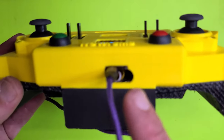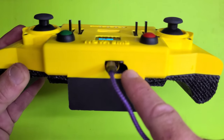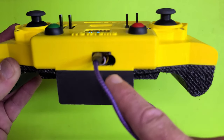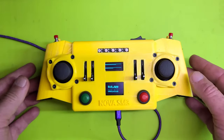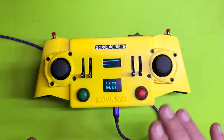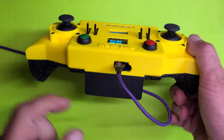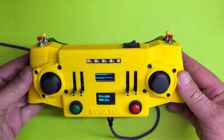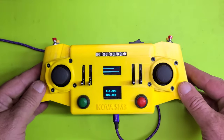Oh yeah, Jordan, one more issue. I made the mistake of asking you to move that hole down 9 millimeters, I think I asked you. Oops. Too far by about 4 or 5 millimeters, so we'll get the exact dimension on that. All right, guys, those of you who've already printed, don't worry, you can still go ahead and build it. I'm sure these kinds of things you can just cut out like I did for now. If it bothers you, it's really just that and the JST connector.